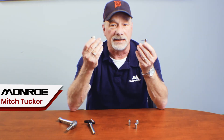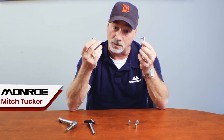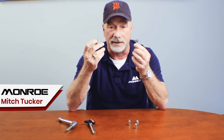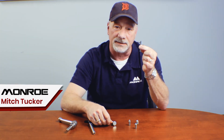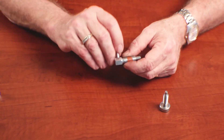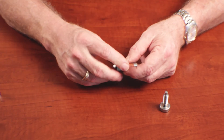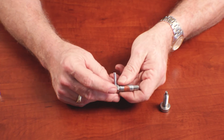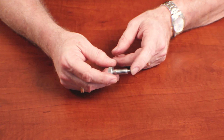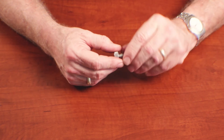As you can see, indexing pins, like most spring-loaded hardware, come in a variety of styles. The ease of use is a very important consideration. Indexing pins can be designed with very light springs that allow very easy and obvious adjustment to hold them into place so that they can be easily used. You can positively hold parts together and only have them pulled apart when intended.